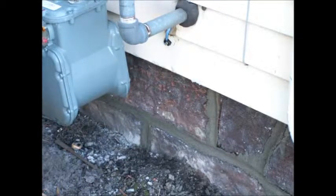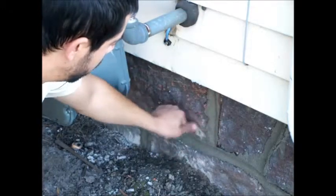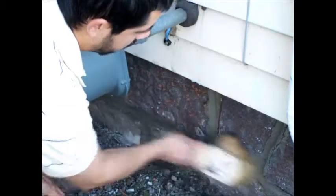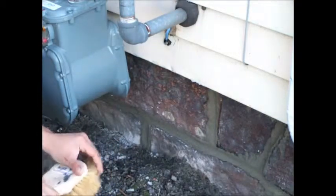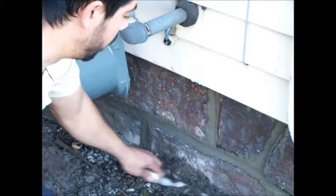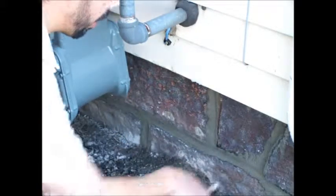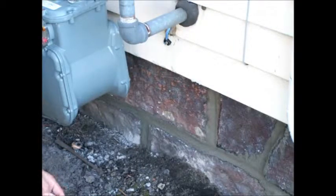The final step in restoring brick and block is to take your brush once it's dried — you can see now it's not smearing or anything, it's pretty well ready — and just brush it to remove all the extra mortar and give it a nice professional look. Once you're done brushing, take your tuck pointing tool or margin trowel and scrape all the droppings away. You want to wait until the end to do this part because when it's all wet it'll just smear and make a big mess. But now it's nice and crumbly so you can clean it up easily — just scrape it away, put it in your bucket, and put it in the garbage. You're all done. Thanks for watching.